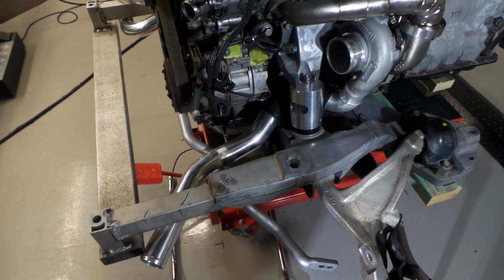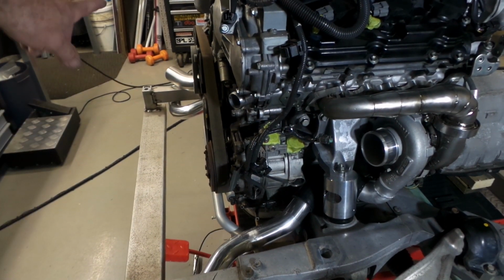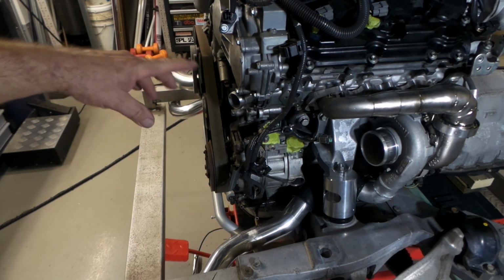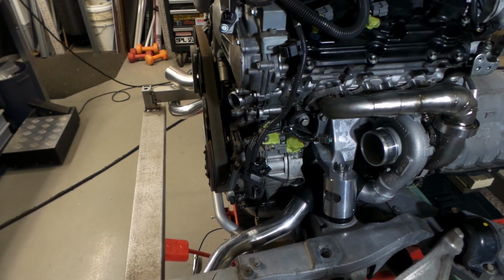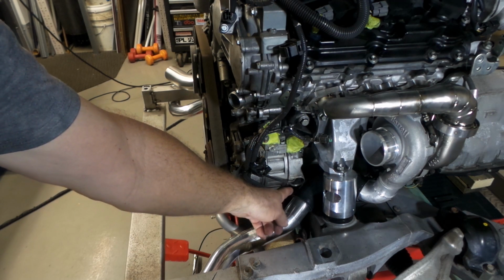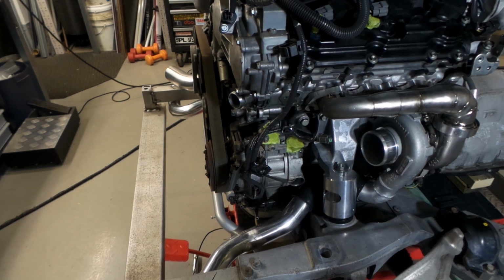You can see the pipe on the other side comes out at about 90 degrees, sort of straightforward. Now that doesn't have to be like that, that's just how it's ended up with working the bends and where I could get the last bend on there. But because this side's started in on a better angle, I can sort of come out here. I don't know, I'll suss it out. I might be able to just leave it like that. At least it means there's less of a bend going into the intercooler on this side, but we'll see.